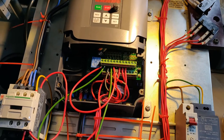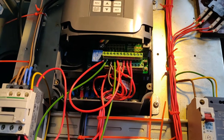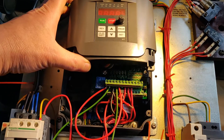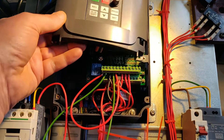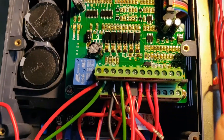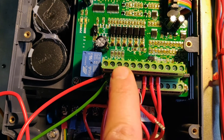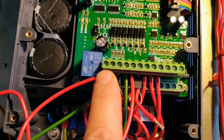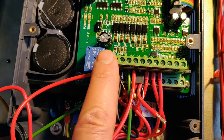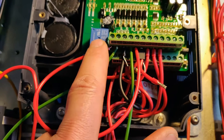There's also a feature on this with auxiliary pumps, so I tried turning those on and nothing. So I decided to look a bit further at the schematic on the PCB. I pulled the control panel off and here's the PCB. This is the terminal block — remember there's six inputs and three outputs. The two open collectors are these two end terminals, and the relay is actually connected to the ones under here, and that's the relay there.